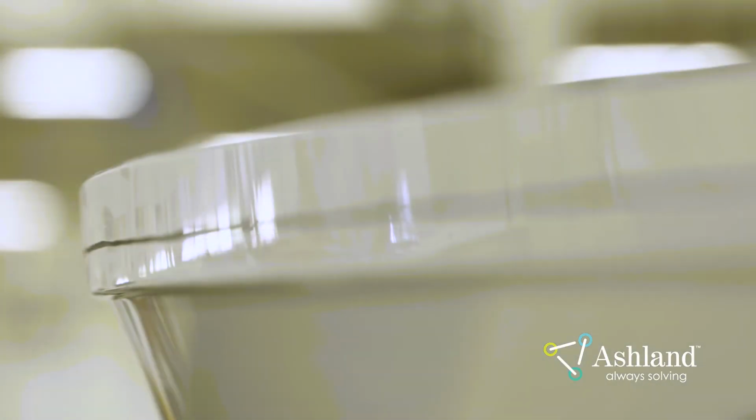Using a Dremel tool, cut completely through the gel coat and into the laminate. The scribe line will give a surface crack a stopping point if a crack develops from a screw, as it disrupts the non-reinforced interface layer.